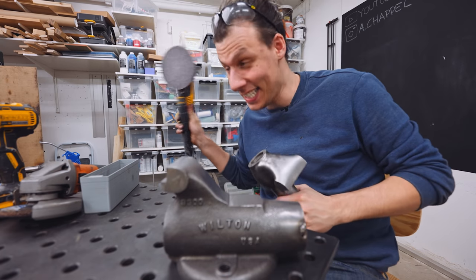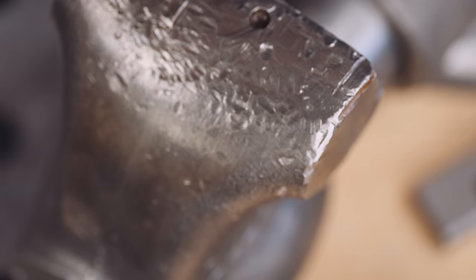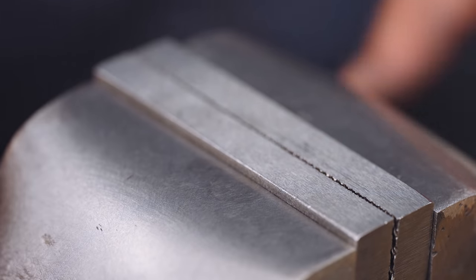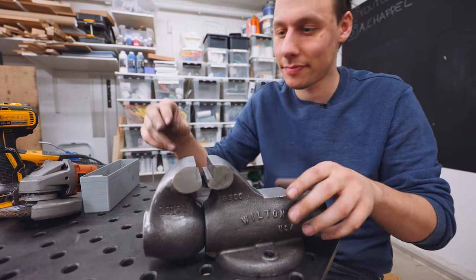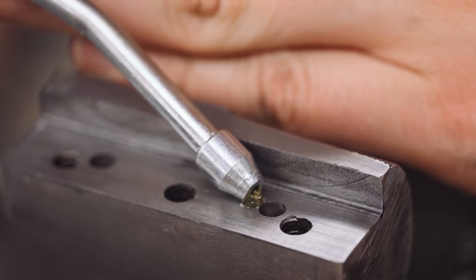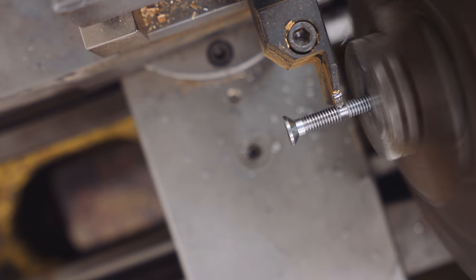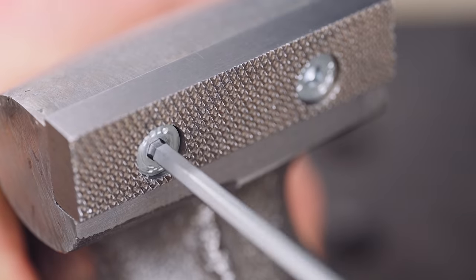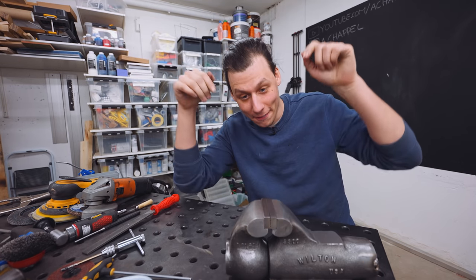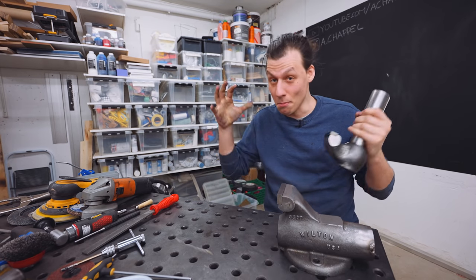After a bit of angle grinding and sanding, these things are starting to look really good. I am really happy with how perfectly these jaws fit now. Looking back at how beat up these pieces were, going from that to having the jaws fit perfectly together — I'm really happy with that. So the next step is to attach these, and I'll have to modify a couple of screws to make everything fit together. Just tightening the last screw — that's one jaw, and here's the other. We finally have a vise with two very nicely mounted, square jaws. This is really starting to look like a vise. In terms of functionality, the most important part is done.